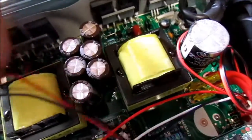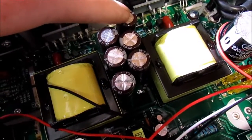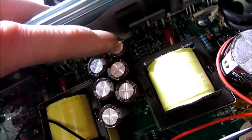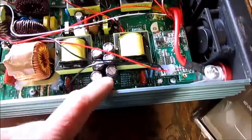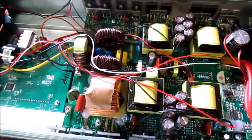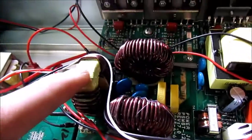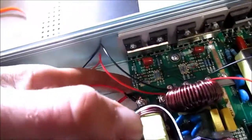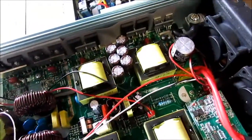And then these two — look at these two, just wired out of the way. If I move one, why does the other one move? I'm wondering if the rail on the bottom side is broken off the board that these are attached to, and they're moving together. So I'm taking some hot glue and I'm going to glue around all these bottoms just to hold them better. It's interesting to see boards stacked on top of boards here — this is a separate board screwed to this board.